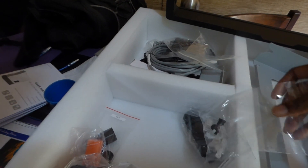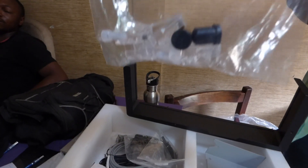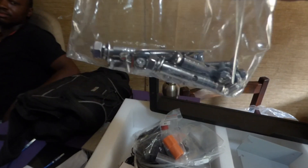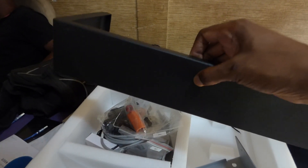There's one connector I'm not sure about yet, but we'll figure it out. There's an RJ45 — we decided to build our own cables, though I prefer less complication. Here is the EPS connector, which is the side that powers the house from the inverter. The AC connector is the side that comes from the grid. They also give you battery positive and battery negative, plus the studs to mount it on the wall, a small screwdriver, an Allen key, and a mounting bracket.